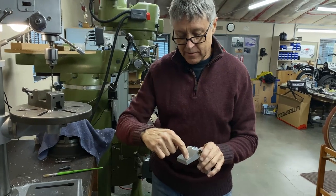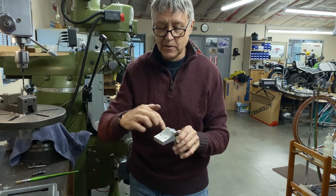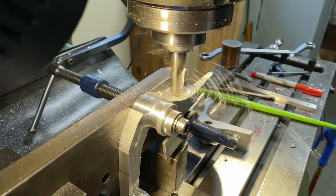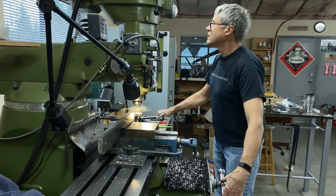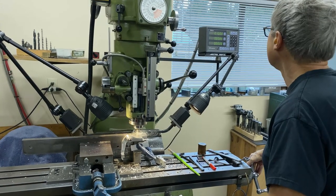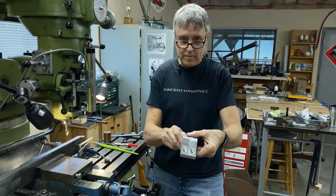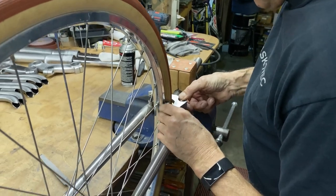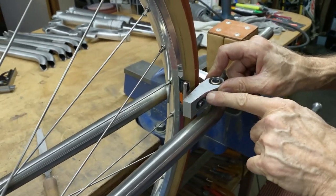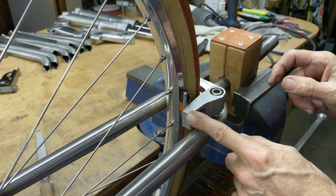Why don't we do the pocket now? There's going to be a pocket where the back of the brake pad goes into — there are two washers and a nut. That's our two pockets. The hole is in the middle and we still have to put in a slot — a hundred thou down and a hundred thou up — but that's looking good right there. Happy with that.